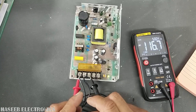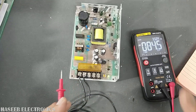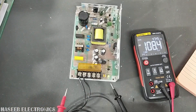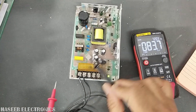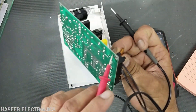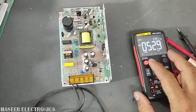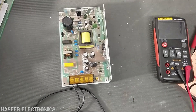If one side reads 116 volts and the other reads 220 volts, there is a problem. We have to inspect these components, check the metallic tabs of switching devices, and use insulation paper between the metallic chassis and the PCB. The chassis mounting screws on the PCB must be installed firmly to make a good connection. These are the points to verify and check. I hope this video is informative — hit the like button and leave any questions in the comment box.